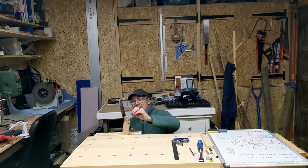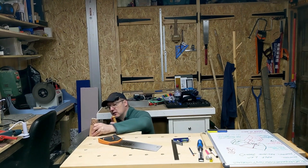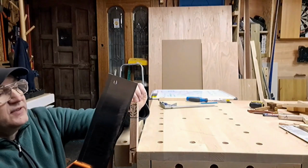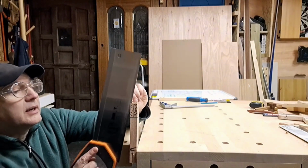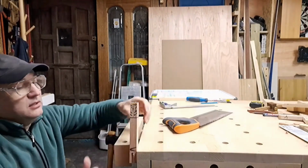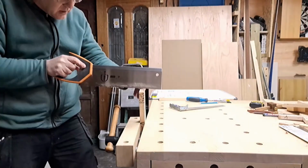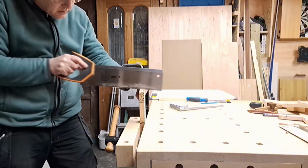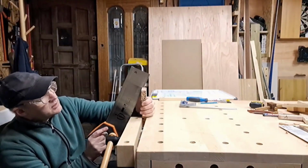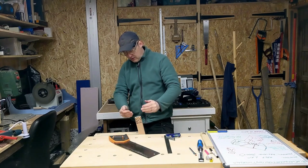So with that, I actually want to get down here and follow that line. Because my vise is in the way a little, I'm going to have to bring that over here to the edge of that vise. And I'll still be able to keep that line plumb. That's quite plumb for me. That's good. My saw can fit in here. And on that, I'm going to run a kerf line down here. Good. Since I'm on this side, let's do that one. Try and keep your fingers above the blade. That will catch in there. Now, this is the second step of this one. Tighten that up. So that's 1 across the top, 2 for the kerf.